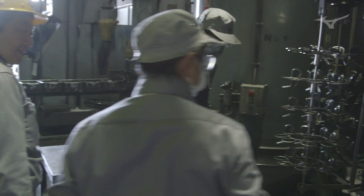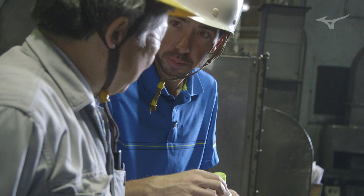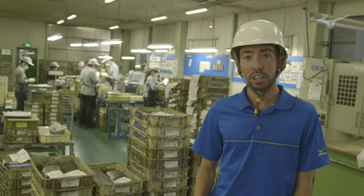After the second hydraulic press, it goes into a sand blast that actually removes any of the impurities that have started to oxidize on the golf club. That blast takes about 15 minutes for a set of heads. The clubs already have score lines at this point, so this is final. This is the final stage of a club being made at the Chuo factory — clubs are getting the final logos placed on, as well as the inspection samples before they go out to go into your bag.